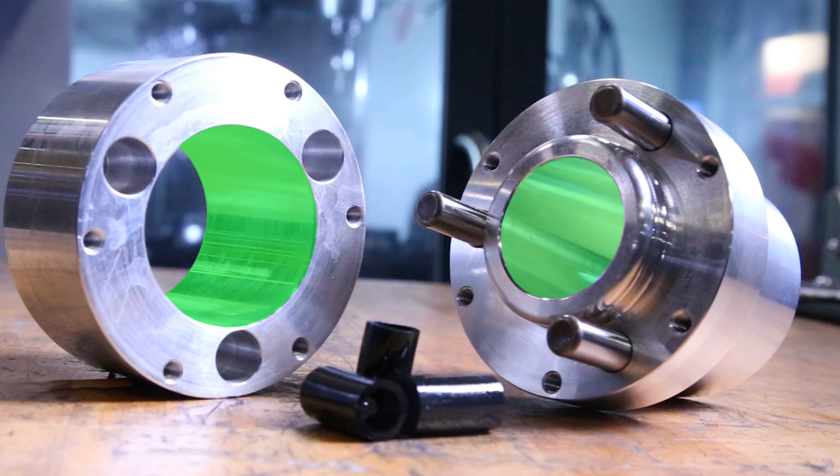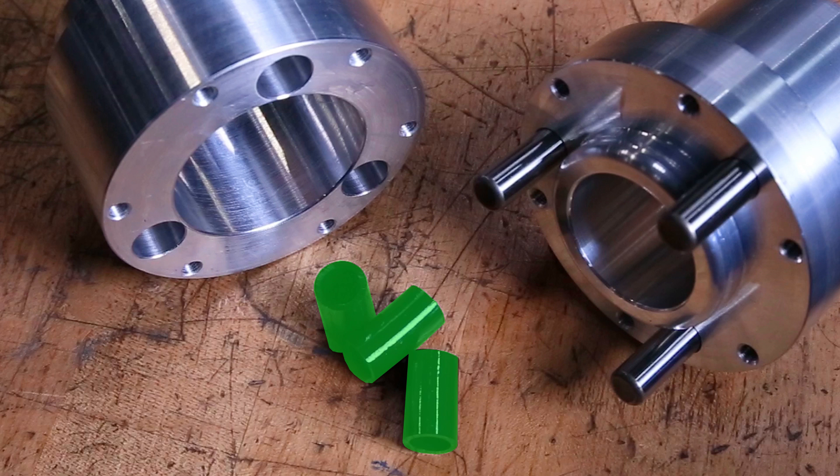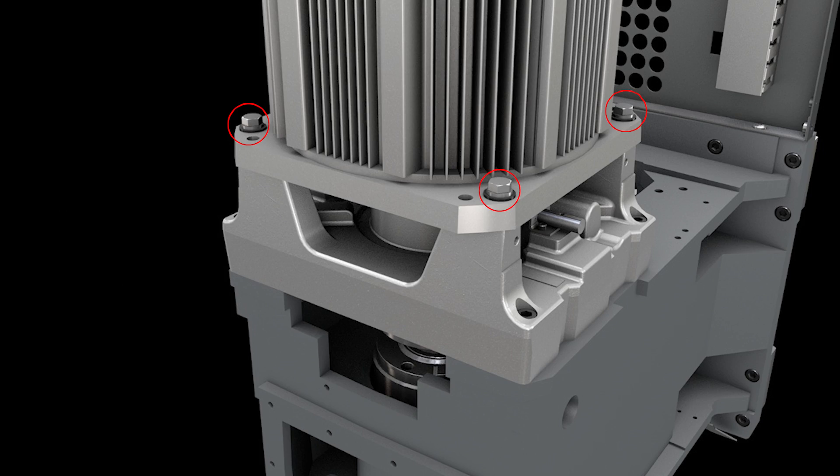Apply a small amount of grease to the polyurethane sleeves, to the grease catch on the pin side of the coupler, and right inside the bore on the receiver side. When installing a spindle, I like to leave the motor bolts loose — that allows the motor to slightly lift if the coupler is misaligned, and protects the spindle bearings.